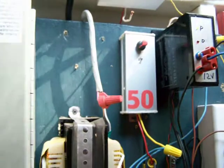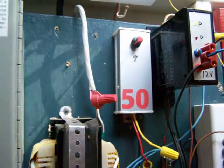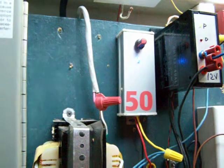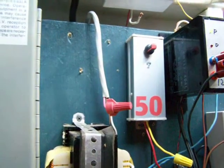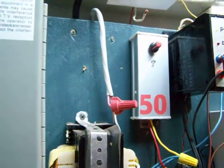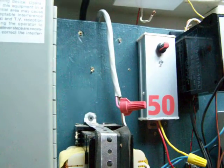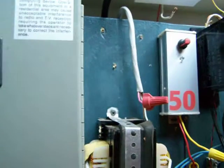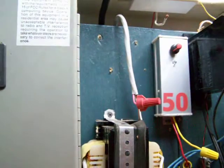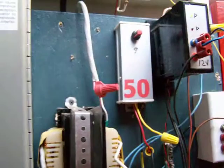What I had before is kind of like this — it's the Blue Sky — and what it does is it's a little 72-volt to 12-volt converter that I modified up to operate at power point. They say 15 amps but it's a good solid 6 amps that you can run forever on it. I had a couple of these in parallel — that's a sweet little system, cheap, and it works great.